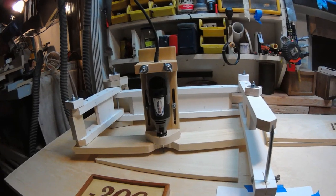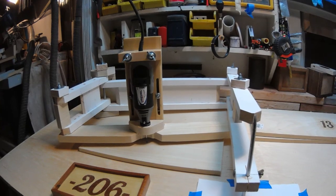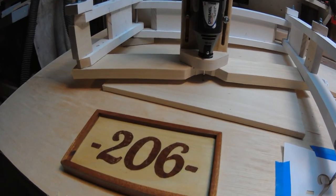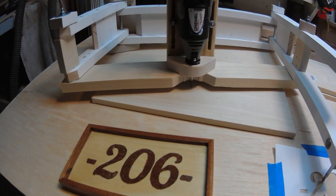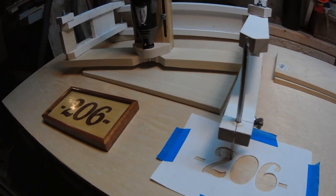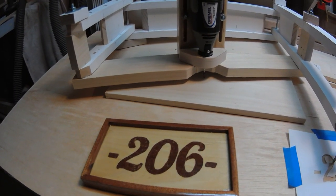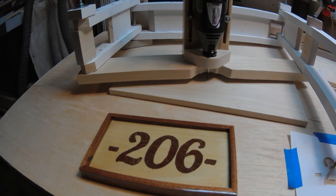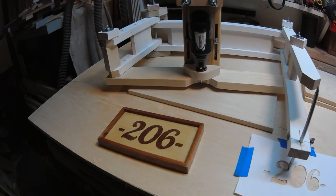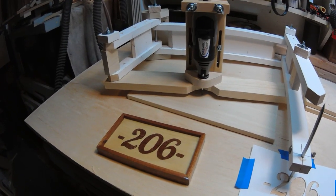This essentially gives you a 50% reduction in the size of the letter you're copying. I've done this one with mahogany inlay. I used the router X-Acto knife and simply traced the pattern on the wood, then routed out the trench, filled the trench with fine mahogany dust, and impregnated it with CA glue, then sanded and finished it. So while it looks like a painted surface, it's actually an inlay.